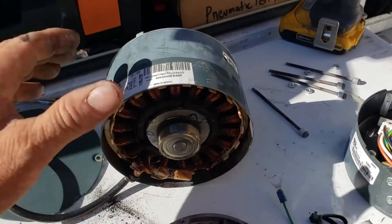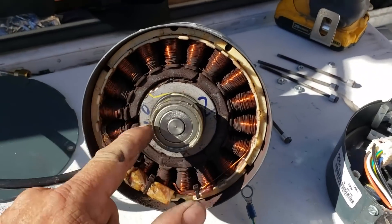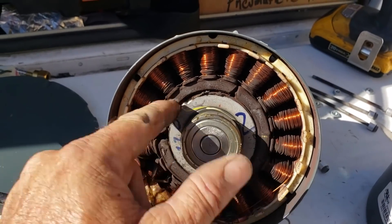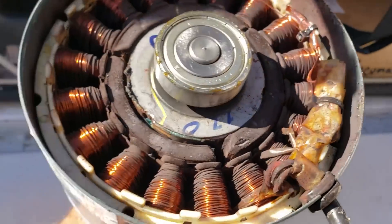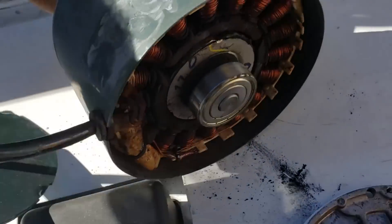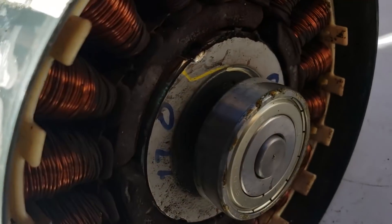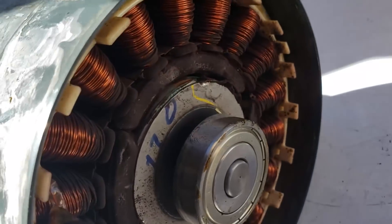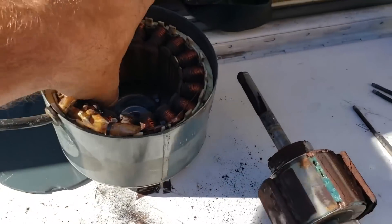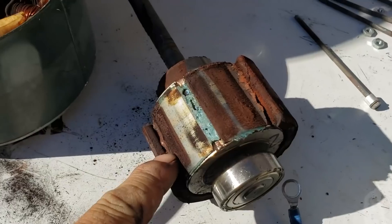I just popped the back cover off, and this is a first for ECM failures that I have ever seen. The bearing right there feels good. Look at that — the permanent magnet that's bonded to the armature broke and came off. It's stuck on to the stator, the windings. So that's why I'm getting a little bit of a turn. That's why there's a bunch of metal shavings. If you force-turn it, it's spinning everything with it — it sounds like ass. There's half the magnet stuck in there. Came off — it lost its bonding.